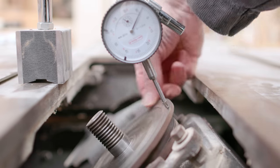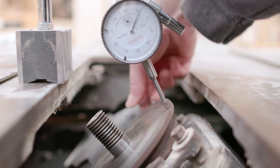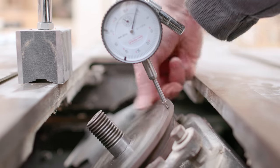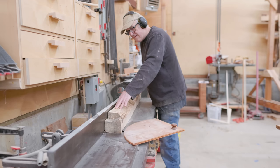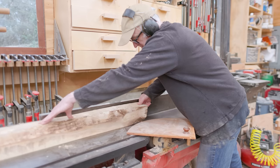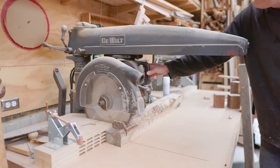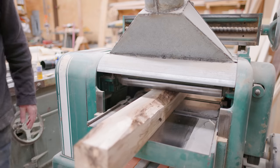I thought I would give Matthias's method a try. The idea is to use the table saw almost like a lathe, then hold a grinding stone on the arbor plate to flatten it as the table saw is spinning. I found a big chunk of oak to hold the grinding stone against the arbor plate, jointed two of the faces, and then planed two of the faces.